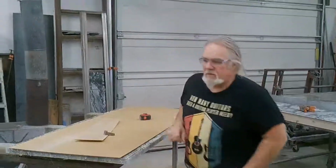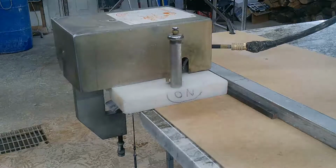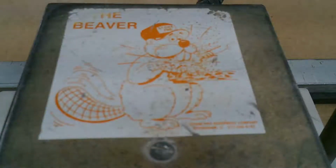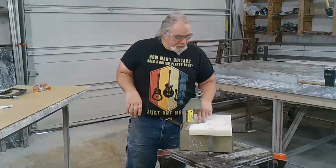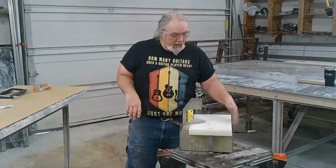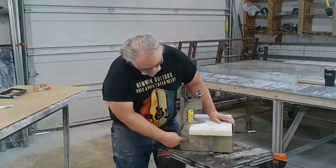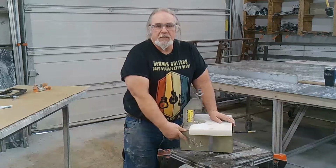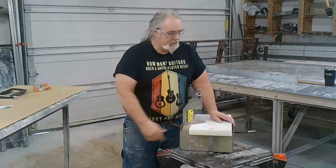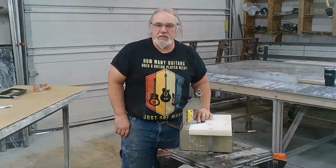Now, on this particular tool, this tool has an absolute setting, if you will, for where it has to be in order to function. And so what we do is, from the pinch point to the back of the machine, I've written it on here so that it's kind of a no-brainer, that you know your chisel to line can't be any further than 7 3/4. That's the distance from the back of this high density plastic to the pinch point with the teeth.